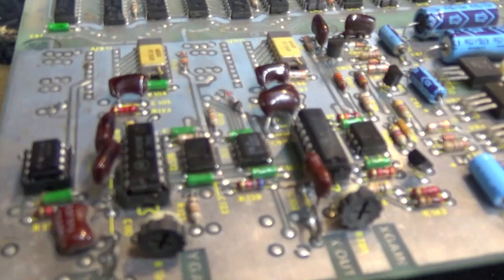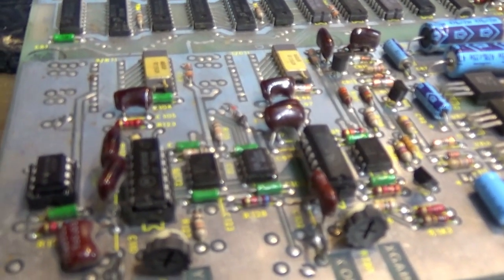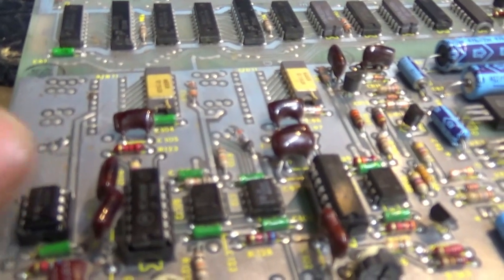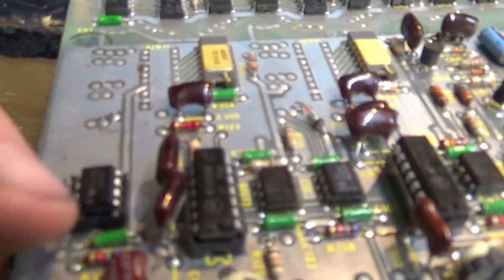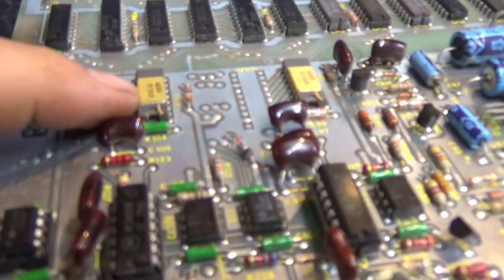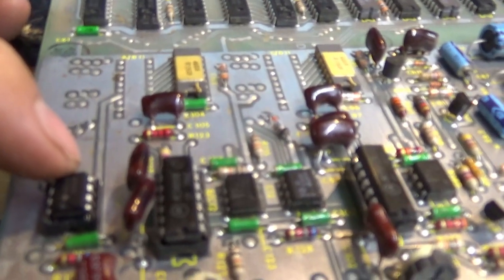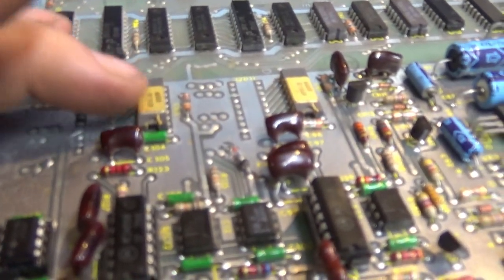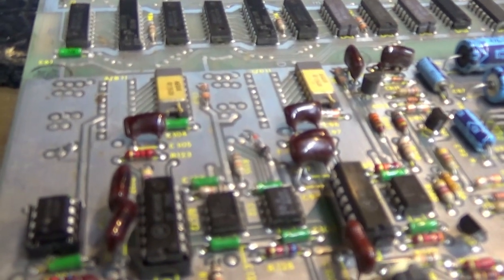You know, there's something I wanted to mention on video and I forgot. Now, this is just a theory of mine. It's not set in stone. I could be totally wrong. It's just a guess, okay? But since this NE5532 takes less work, you know, it's impedance, but let's just say resistance. Let's say it's really high resistance. So it takes less current to operate than a TL082. So that means it puts this DAC under less of a load. So this DAC does not have to work as hard to make this op amp operate. So it's possible, this is my theory, it could lengthen the life of this hard to find DAC by running an NE5532. Now, like I said, I can't prove that. That's just my theory. But anyways, back to the video.